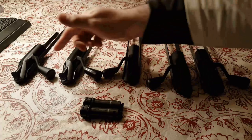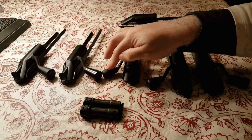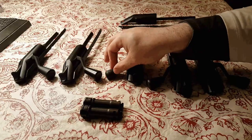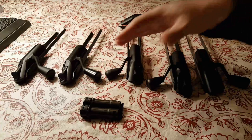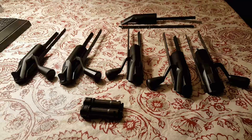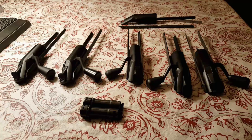The major difference I can see across all of them would be the bolt knob. They are different profiles - the Tactical 2 had a kind of teardrop shape, the LRS 2 has a flat more rounded shape, and the first generation handles are a very conical shape made of plastic, while the LRS 2 and Tactical 2 bolt knobs are made out of metal. But they're all interchangeable - they're standard M6 thread, you can thread up anything, and you can even put a standard R93 round bolt knob on if you want.